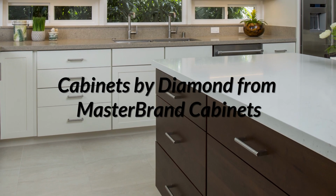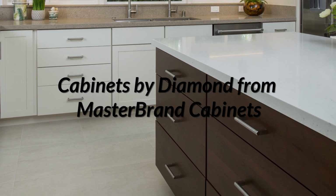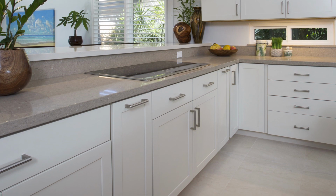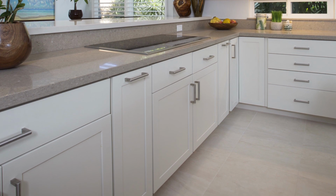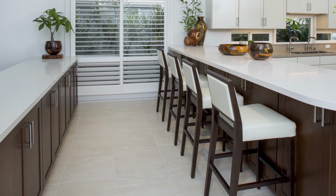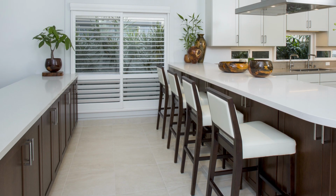Initially, when we first started, they had a frameless cabinet, which is a European-style cabinet. The doors are attached to the inside of the box. I'm not saying it's going to be a problem later on, but you do have the joinery of the cabinet. To me it is not as strong as a framed cabinet, where the doors are screwed straight into a face frame. So you do have some issues there in terms of strength. I think one is a little better than the other.